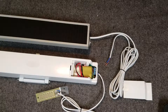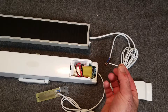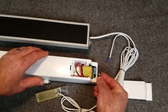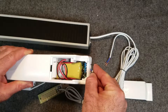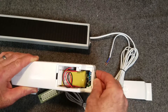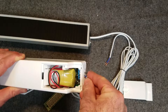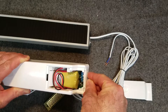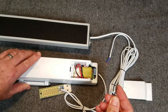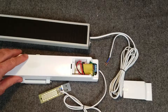You can do that in a number of ways. One, you can take a small nail — a little finishing nail — or an allen wrench. All we're doing is reaching into these holes and pushing open the tab. I have resistance there, so I'm just going to push until it slides in further. Then back it out and do the same on the next hole — push until you have resistance and then push it in further. The allen wrench gives your finger a little more surface to push on than the nail, but a nail certainly works when you need it.